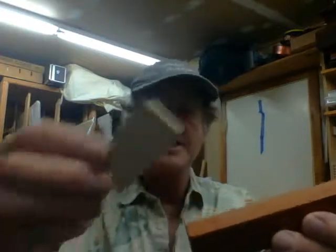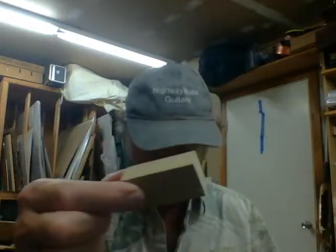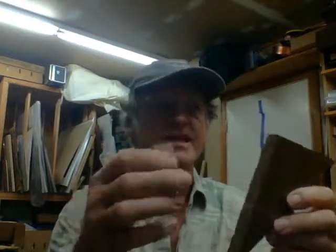So I'll be sawing off little strips of these. This is pretty red, some kind of redwood. It's really soft, but it's pretty. I know this is a piece of poplar. It's nothing special except it's just light and provides some contrast. And this might be walnut or something like that. Anyhow, I'm going to saw little strips of these parallel to the grain, and then I will sand them on both sides so that they have a good glue joint. And so you don't really need to see me with my pull saw in the vise, but I will time it so you can see how long that takes.